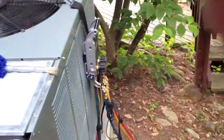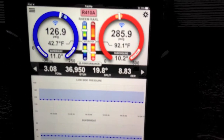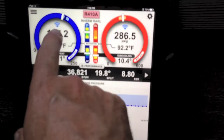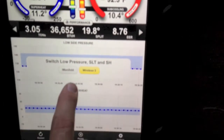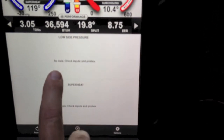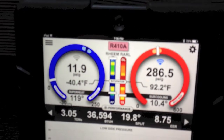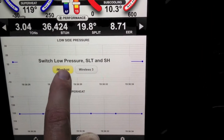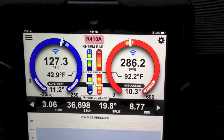Got the manifold just hanging over here. The hoses are hanging off of it because the probes do talk back to the manifold. But you can see right now wirelessly I'm measuring my capacity — I'm doing 3.07 tons of cooling, 36,000 BTUs — and I've got my wireless high and wireless low pressure probe. If I tap this it'll pop up the manifold and I can go back to i-manifold on that probe. And if I tap it again it'll go back to the wireless probe and do the reading.